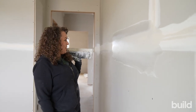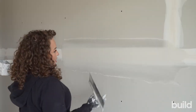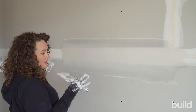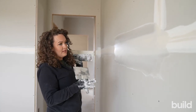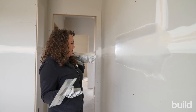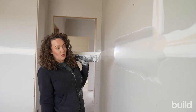That's how we coat a flat. We also sand in between — for the next coat before this one, it'll get a light sand. Always let it dry before you come back and coat it again. You don't want to be going wet on wet on wet — make sure everything's nice and dry before you move on to the next coat. Anyway, that's it for me — just some explanation of how to coat a flat, what to be looking for and not to be looking for.